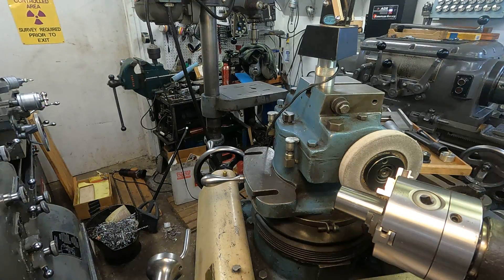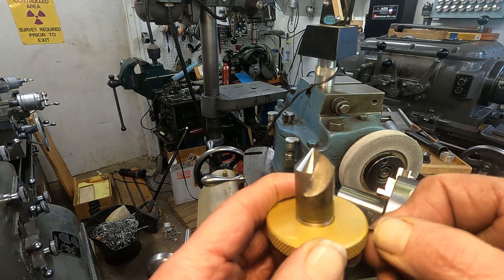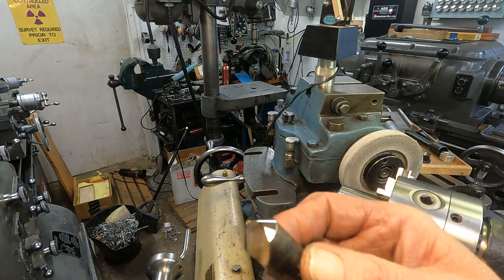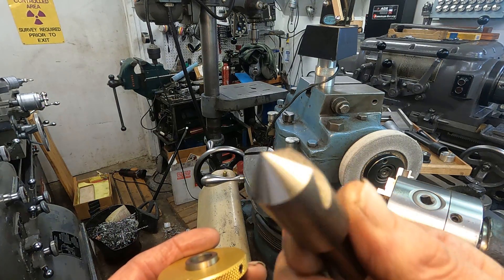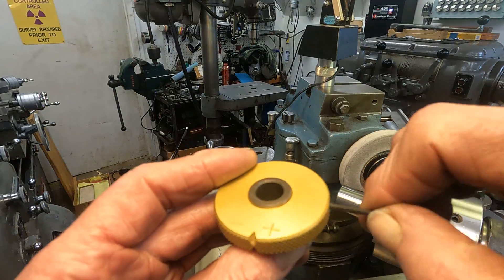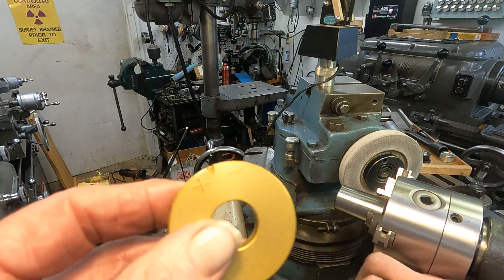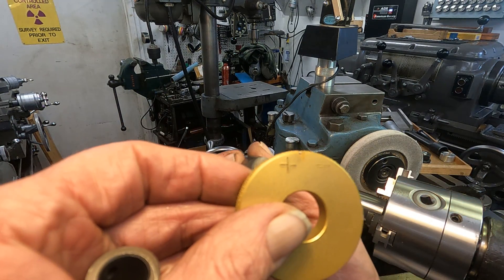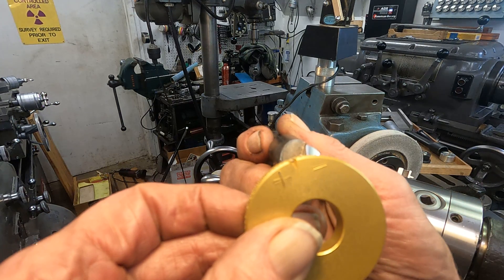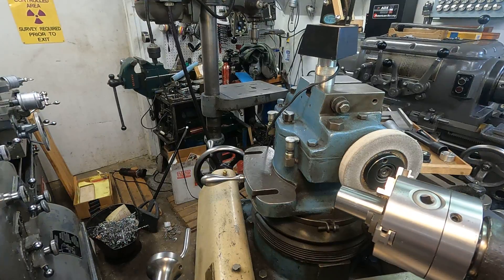To recap: the body's in here, you use these sleeves — this one's done, we'll go ahead and take it apart. Crank it all the way out, pull the cutter out, and this sleeve comes off. When you line this edge up to that notch, you can reduce the clearance by having the edge more towards negative, or increase the clearance more towards positive. That's a lot of control.